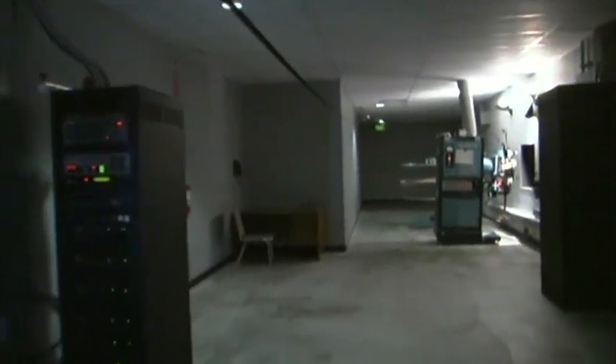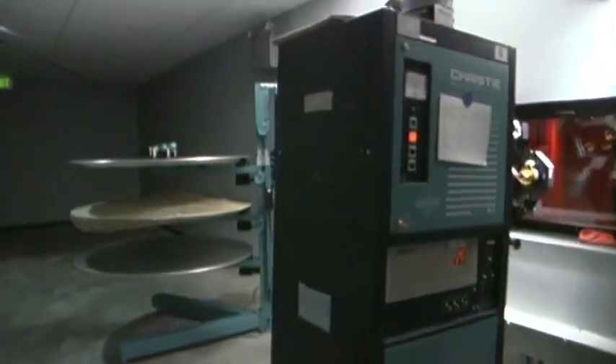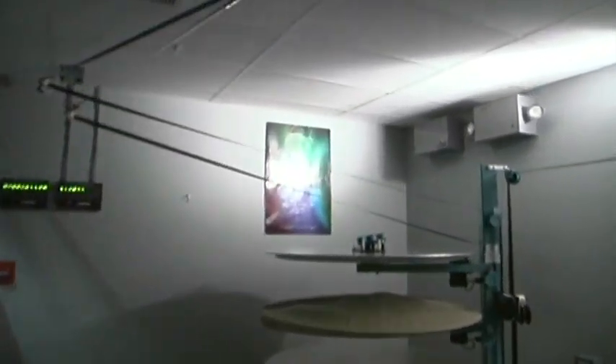Stills of this demonstration are available for more scrutinizing viewing in the Projection Picture Warehouse on the FilmTech website. Number 2 here is the last projector in the north booth. From here, the interlock starts to get a little bit tricky as there are a grand total of four booths in this 16-screen complex. As the film navigates this corner, it must travel down this lengthy hallway through a doorway to reach a temporarily set-up makeup table in the upstairs lobby. This makeup table performs the necessary twist to route the film into the second booth, which houses projector number 1. From this point, the film must travel through two more doorways to enter this projection room. Here you can view another status panel. As of this point, the film is only playing in auditoriums number 7 and 8, as can be seen by the solid green lights.